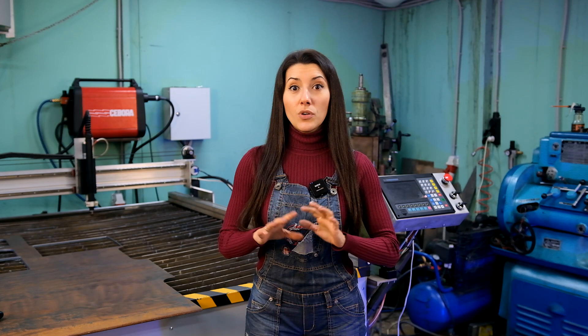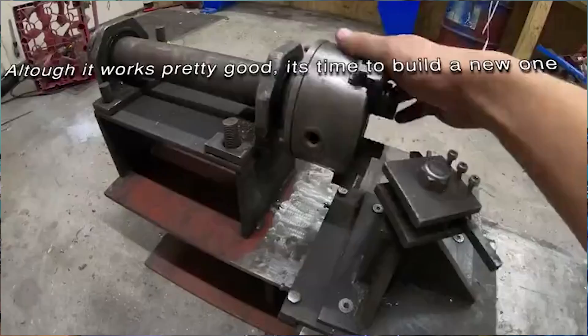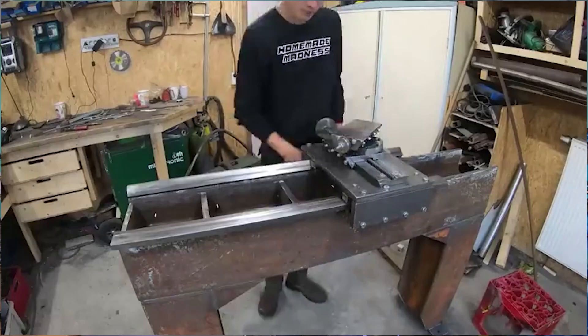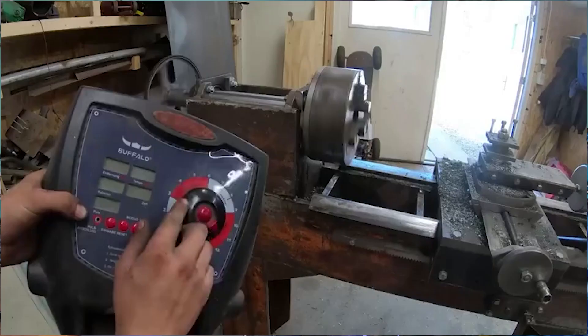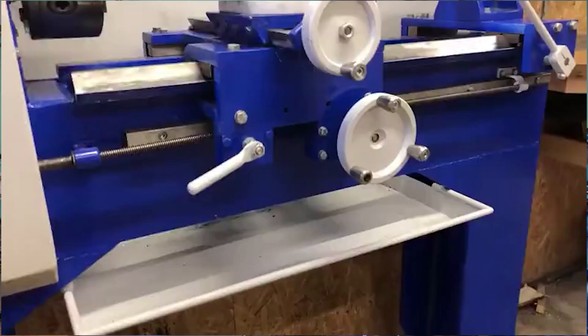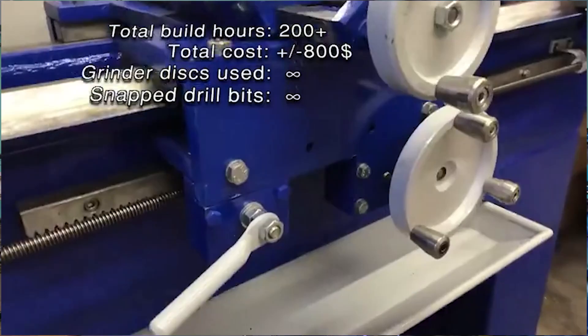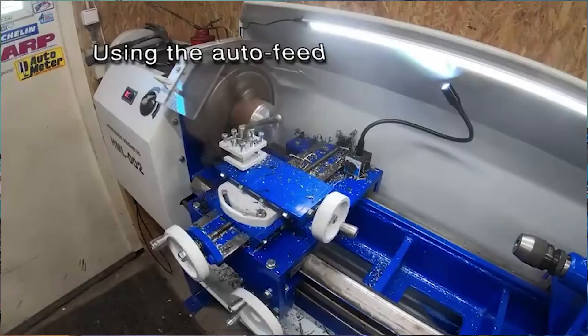In contrast to the previous machine, the next metal lathe was mostly built from the ground up. Watching Jornt, aka Homemade Madness, transform chunks of steel into a beautiful piece of machinery is incredible. Few people have the patience and courage to build such a complex machine bit by bit with just a few power tools. Jornt fabricated each part from I-beams, steel plates and bar stock. He also built a metal cutting table saw and a grinding jig to help shape the steel. Jornt hooked up a treadmill motor together with its speed controller to power the machine and control spindle speeds, then added an electronic lead screw for good measure. Building this lathe requires a lot of elbow grease and is only for those who want a truly hands-on approach to making their own lathe.